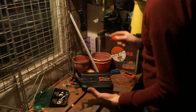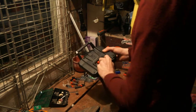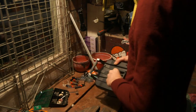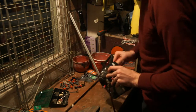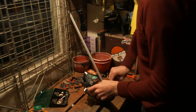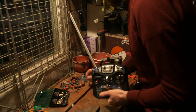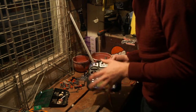The first thing I'm going to do with the Flysky radio is remove the batteries. Then undo all the screws in the back of the case and just take the casing off. Just a quick heads up — this will invalidate your warranty, so only do this if you're confident.